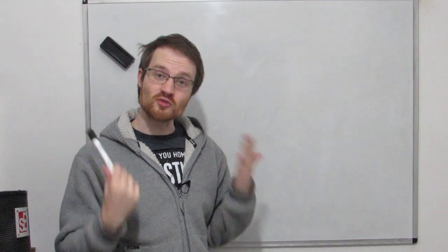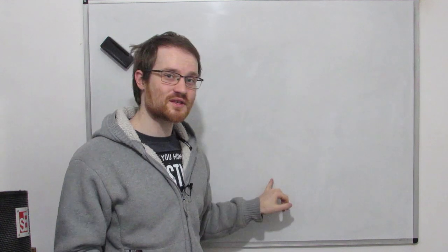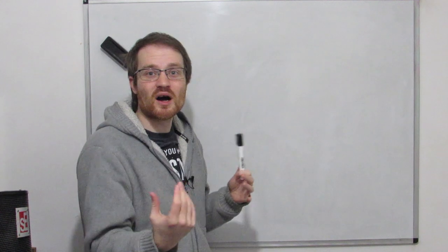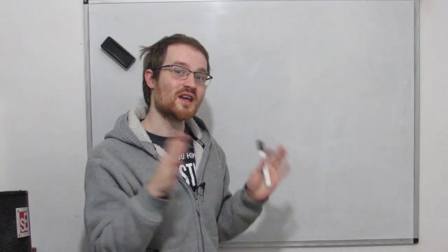We're going to use our control voltage to turn the transistor on and to allow a current to flow through the transistor only when our control voltage is on. And so that's going to let the audio pass in the shape of the control voltage, because as you'll see in a minute, the transistor doesn't turn on and off instantly.